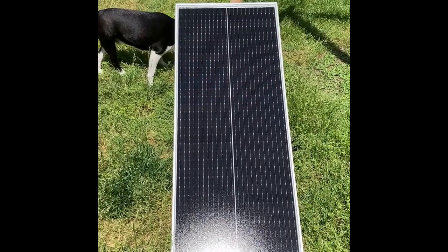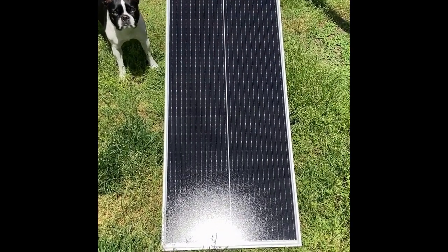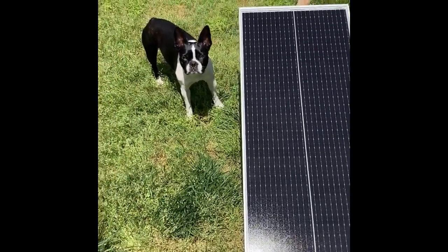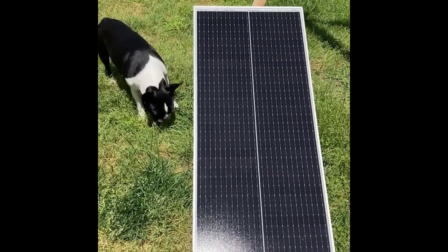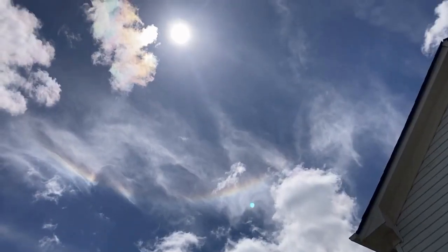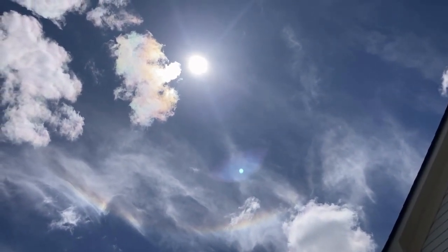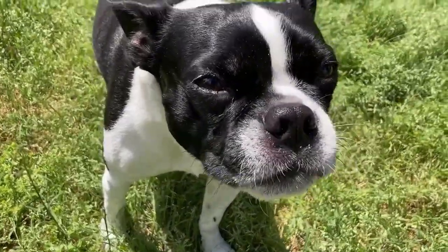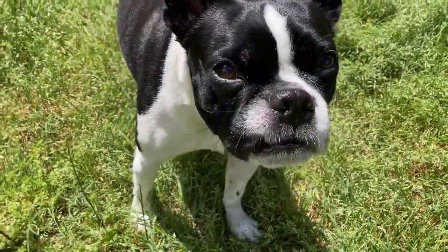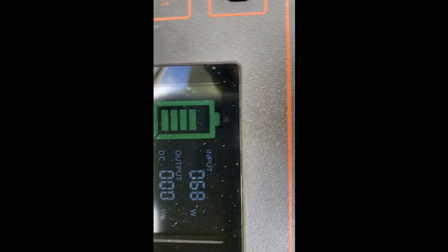We're in the sun and this is a bright sunny day — it's a little hazy, just a little hazy cloud out. Finn's helping me take these measurements. With this sun, you're going to get right up near the max, maybe not quite maximum power out of it. You can see the kind of light haze, so you're getting a little diffusion from the light. It won't be 100% power, but it's going to give about 90–95% of its maximum. Here it is — it's 68 watts. I did see 70 watts on it just a little bit ago, but the picture we snapped here is 68 watts, so that's what we'll go with.